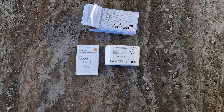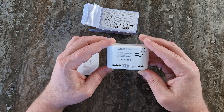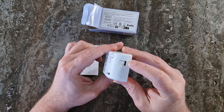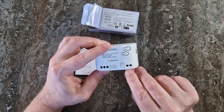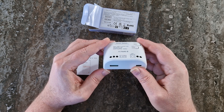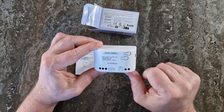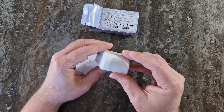Now let's have a quick look at the switch itself. This little Volt Free switch module has two power supply options: 5 volts USB power, featuring a micro USB port — because apparently USB-C was too fancy — and AC/DC 7–32 volts, for those who like their voltage with a side of variety. There's one input for the Volt Free circuit you want to control, a manual switch slash pairing button, and a mode switch button. It looks pretty simple. I wonder if setting it up will be just as easy, or if I've just signed up for an unexpected DIY nightmare.